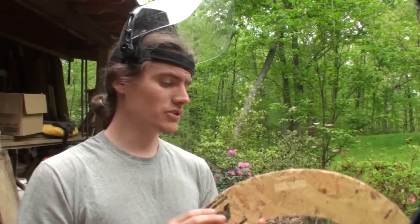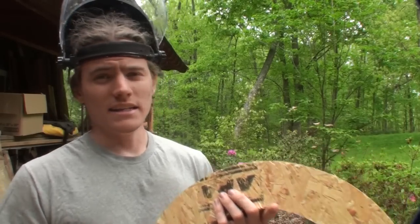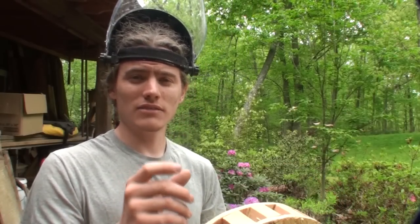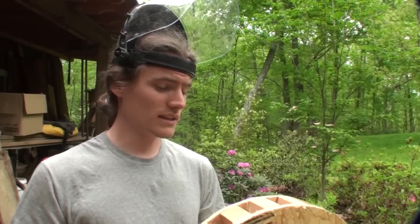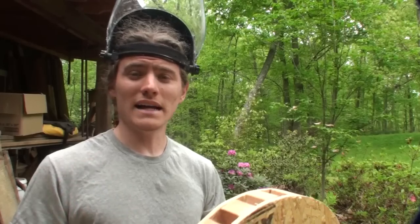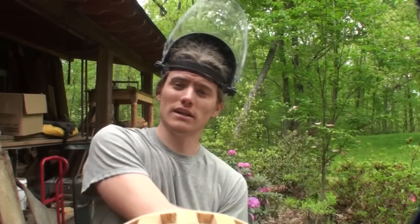I'll probably keep them anyway for the future — I might just decide to use this curve for a project, but I just needed something to get the job done. So the next step is to cut those strips, and those strips are going to need to end up being two and a half inches by one inch thick. I'm going to over-rip them to about two and three quarters and then smooth up those edges and rip that curve to its final width after the fact, because those layers will probably shift just a little bit. Let's go back into the shop, get the table saw set up, and rip some one-eighth-inch strips that are long enough to go around our form.